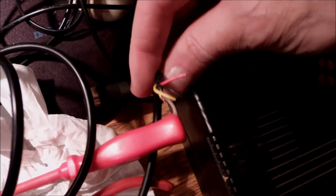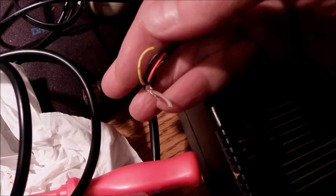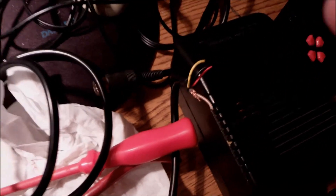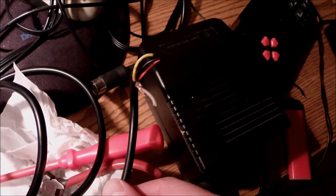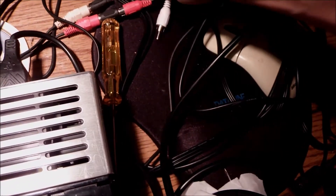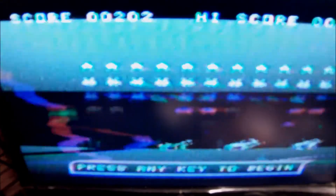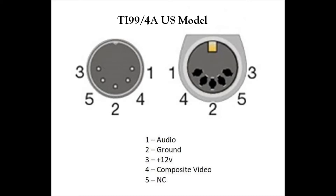The cable has been cut off. You can see only a few signals are here. According to the diagram it's audio, 12 volts, ground, composite, and audio. I'm going to put some RCA jacks on here. The other side is ready-made with the DIN socket, which is very convenient. I'm going to use one of the two sound inputs to the TV and get rid of my old do-it-yourself cable which was giving me trouble.